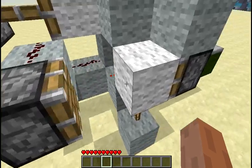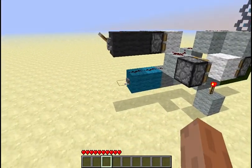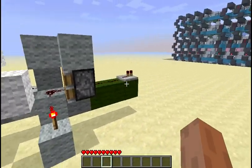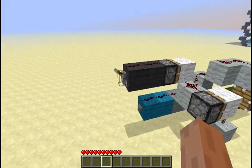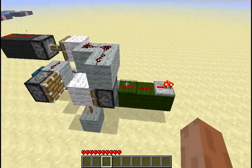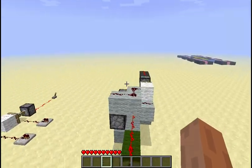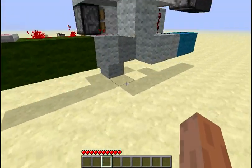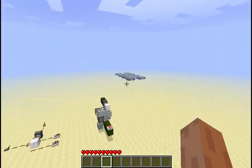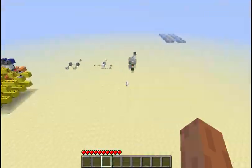So if this is on, it'll push this block here, and if it's off, it pushes the block over there, which switches this off. So when it's on, that's on. This is a stackable design — three wide, four high — and you can stack these on top of each other, they don't interfere, and next to each other. So there are eight of those next to each other to create a byte, which is quite compact and easy.